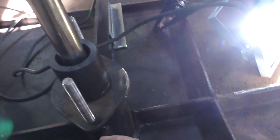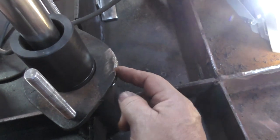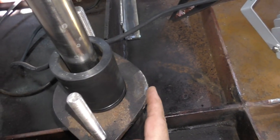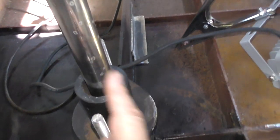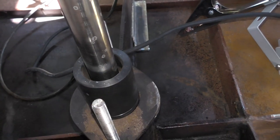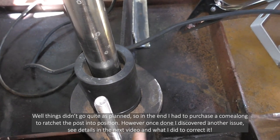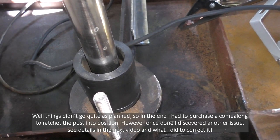What I need to do to even that up is put a wedge in here and knock it in — just get the top edge of this post to move forward slightly. We literally need to go half a mil with that, and that will line this post up with the shaft and the bearing. So I'll go and cut a wedge and knock it in there with a hammer. Hopefully that'll just give me enough spring to push this forward a bit — we'll see how it goes.